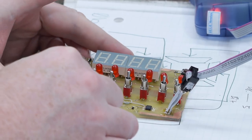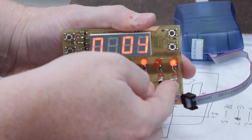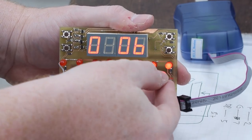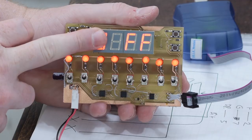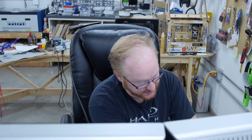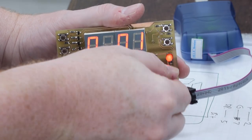There were some digits that weren't soldered correctly and also some of my character defines were messed up — the combination of which made the characters look really bad. But I think we're getting in a good place. I have it forced to hex mode right now: 1, 2, 3, 4, 5, 6, 7, 8, 9, A, B, C, D, E, F. I also shifted the digits over — those are like the original three digits drawing a space. We could probably use this extra digit for a timer counting down. All the digits are working, all the switches are working, the shift registers are working. I just have to reprogram it to use these touch buttons to change mode instead of the toggle switches.